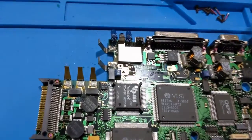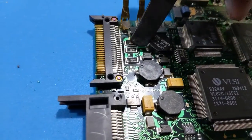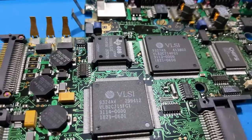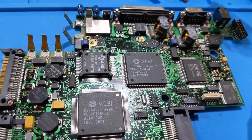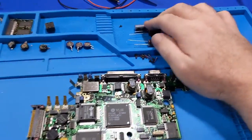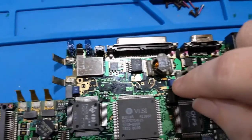I scraped off the solder mask on the affected areas and it appears that as time has gone on, things have gotten a little bit worse. Solder mask is just rotted away. It's probably not that critical - I might be able to fill it in with nail polish or I can actually get that PCB material from eBay. For now, let's just get this thing working. I have my replacement capacitors staged up and ready to go, got my super capacitors there, and my desoldering iron warming up. One thing I want to note: this super cap that was sitting right here has a resistor on it. I don't know why they put a resistor on that, but I'm going to have to work within those confines and bend the lead up and solder that resistor on there.